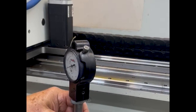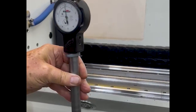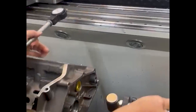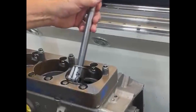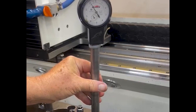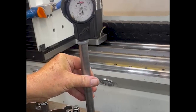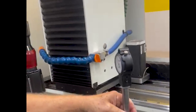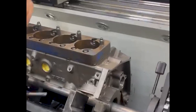So it's two and a half thou big, and then it's out of round depending on where you go. Basically that's not torque plated — we don't know if they did it. That's a thou and a half out of round at the top with the torque plate. So it's in bad shape, no matter how you look at it. A coating's only going to do so much.